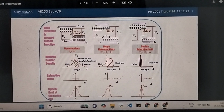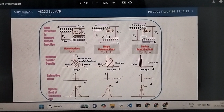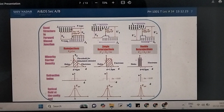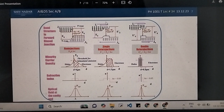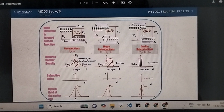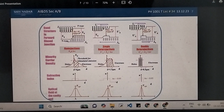That is that. So this is the diagram we already saw when we were just looking at an intro to semiconductor lasers, normal homojunction. This is single heterojunction where we only add the n layer extra. So your holes are as usual, they are the p region that ends here. Actually it ends here and this is the junction region, and your n region is a little extra, it extends up to here because you are adding one extra n region. And in double heterojunction, you are adding both p and n.